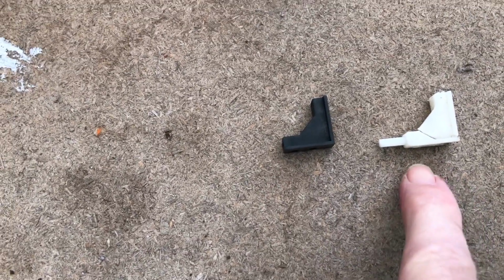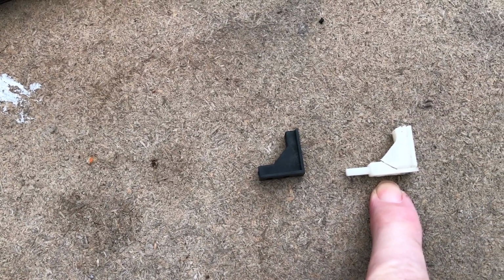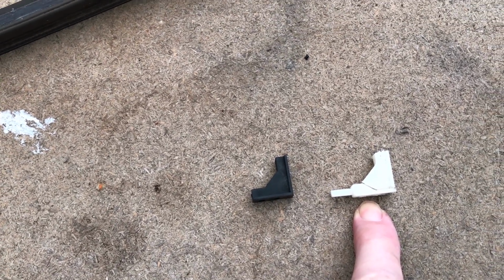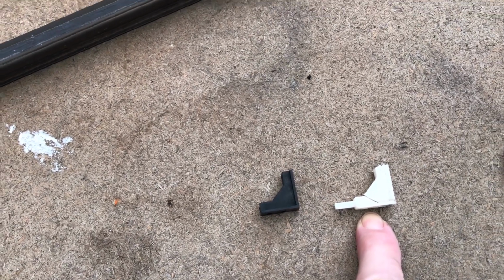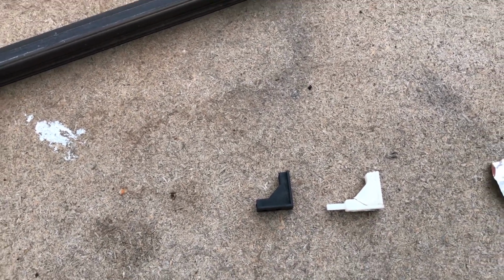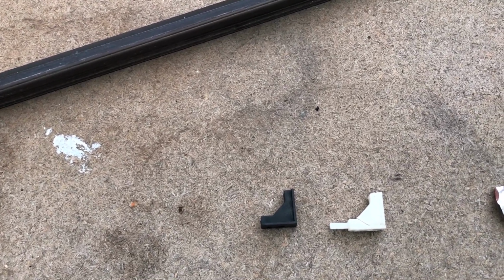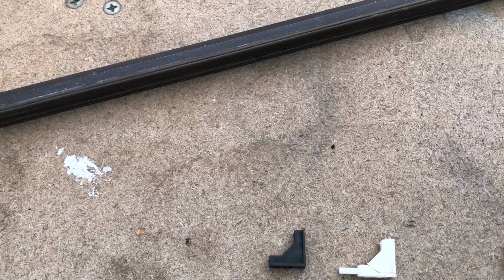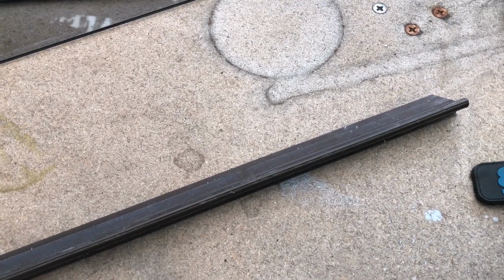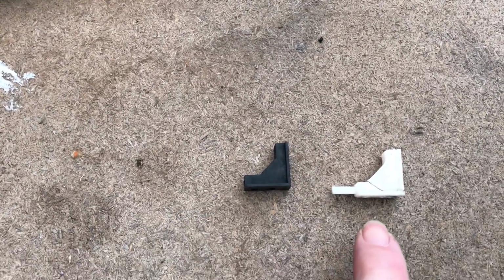This is the original. And these ones here, the more I look at this window now, pretty sure this was actually made in Melbourne. The extrusions could have come from the original company being Myers Taylor / Hunter Douglas in Brisbane, in Geebung, because they sold the business to Bowater / Caraparts a long time ago, and in turn they only ever made mill finish windows, and this is a dark bronze anodised window, and they were only done in Melbourne in later years. So anyway, that's an original.